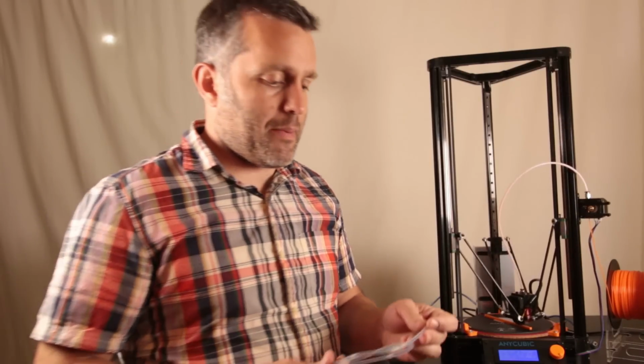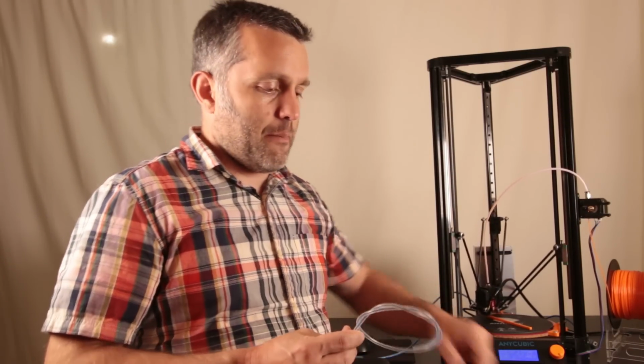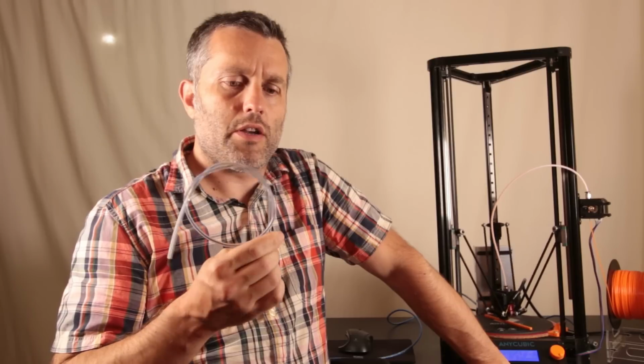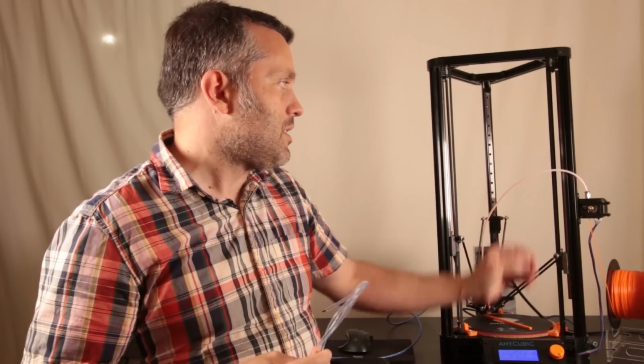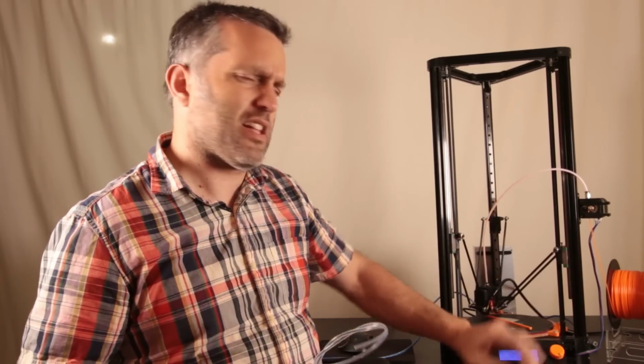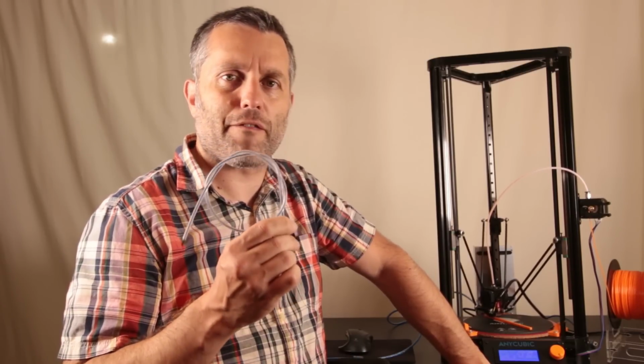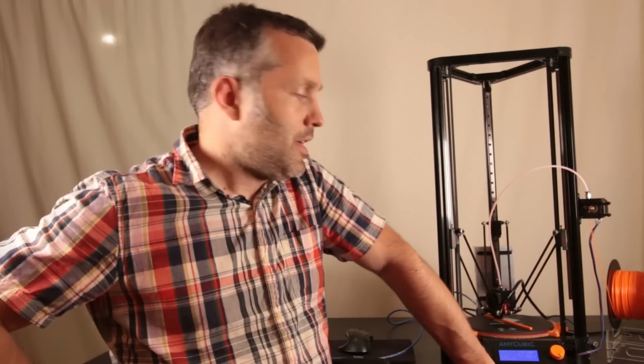Oh, hey, one more thing. This might be the last video I make about this Delta printer. So if you get this printer, make sure you replace your Bowden tube. You've got to get this PTFE. I think that's what it's called. PTFE? Yeah, I'm pretty sure. The plastic tube that comes with it has a lot of friction, and you're going to have problems. I had problems. So I kept forgetting to mention that.